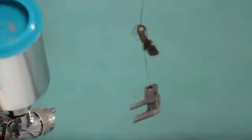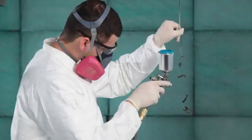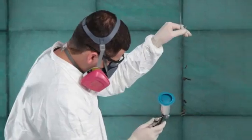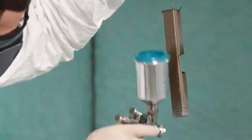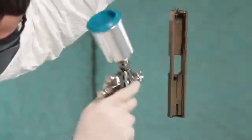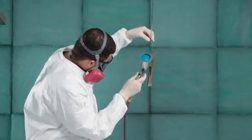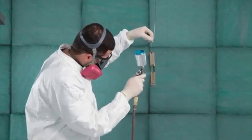If a mistake is made during spraying, such as a run, do not attempt to wipe down the part and respray. Rather, partially cure the part in the oven for 20 minutes and then return the part to the blast cabinet and blast the CERAKOTE off the part. Blow off and then respray. Note: discard any unused mixed CERAKOTE according to local and state regulations. Do not return any unused mix to the bottle.